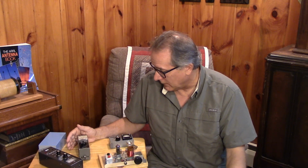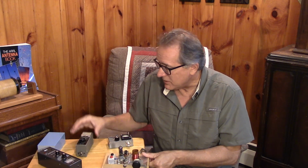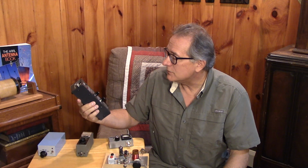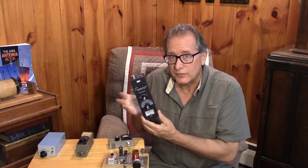And here at Microwave One, we try to keep it really simple. You've got your SWR meter and maybe a little QRP rig. That's one way to do it, to match the SWR with these loops. Maybe you've sprung for some type of MFJ antenna analyzer. This is a very early one, very primitive. It only goes down to 1.4 megahertz, however, and it's pretty low power. You might have a problem exciting the loop with something that's this low power.